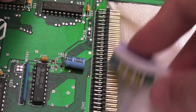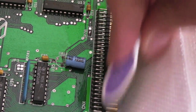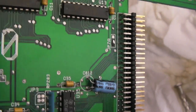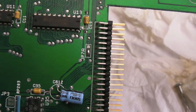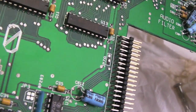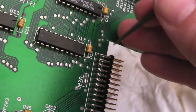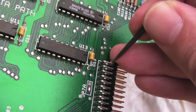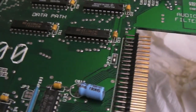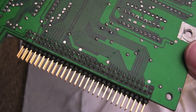That expansion connector is looking all right - still a bit green on this side, but the top side has come up super clean. After about 20 minutes of scrubbing with some vinegar and mostly IPA, you can see it's come off. The technique was to use this tool and just gently touch the surface - the green stuff was just falling off. That's come out pretty clean on both sides - it looks almost as good as new.